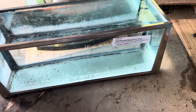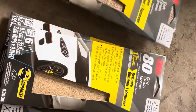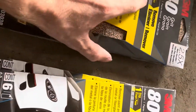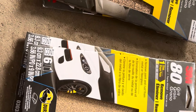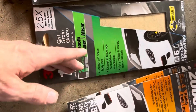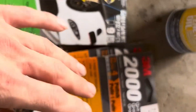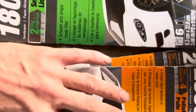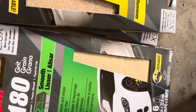Here's a list of the items you're gonna need. You're gonna need a couple different size grains of sandpaper. You want to start with 40 grit — it's thicker, it's gonna be what gets most of the dings out and kind of gets it smooth. Then you're gonna do 80 grit, then 180 grit — anywhere from 180 to 220 is what you want somewhere in between. And then this 2000 grit is what is gonna give you the mirror finish, the polish. It is very fine and very soft.